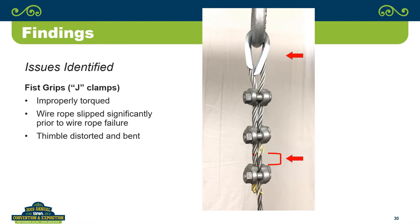We found over torque, or them under torquing it, so we found a device called a torque limiting extension. You put it on there, you can hammer it for an hour and a half, and it's going to put 30 foot pounds on it. So we issued those to all our swing guys, because I went out to a job site and saw a guy doing it. It looks like a normal socket extension, but it'll twist at 30 foot pounds. And they work well. But after he put them on with the gun, I went and got the torque wrench. One was 26 because he didn't want to over tighten it, and the rest of them were 37, 38, 39.